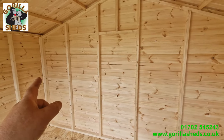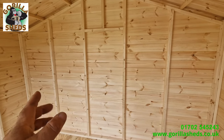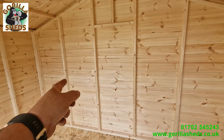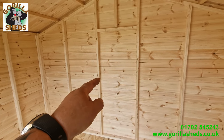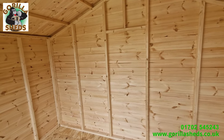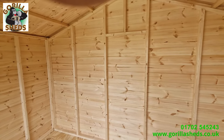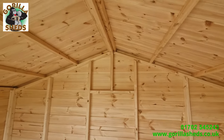We place our uprights aiming to have them no more than two feet apart — 610mm. The reason for that is all timber expands and contracts between winter and summer. If you put the timbers too far apart — three or four feet apart — the timbers can be allowed to move. So we put one every two feet; the cladding is double-nailed at every joist, which stops the timber from moving. We've also got a little frame in there just to support the 4x2.